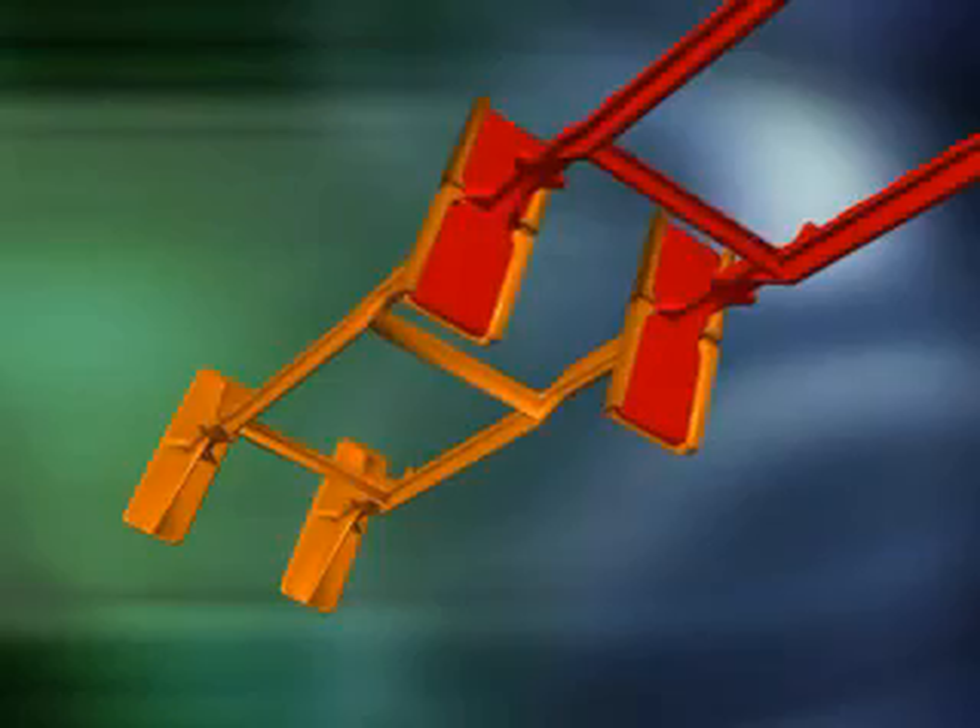Determine the called-out size of the column and select the regular tie that, when attached to the 12-inch extender tie, will form the appropriate cavity size measured perpendicular to the original wall. These ties are best cut into single ties before assembly and emplacement.